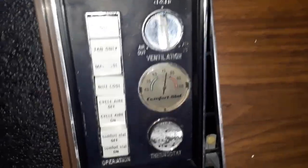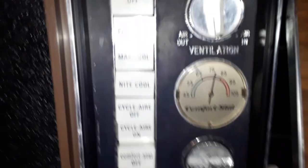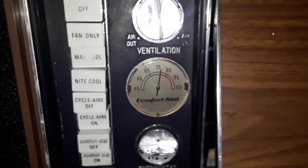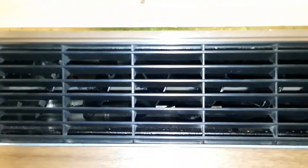She's holding head pressure pretty quick and the thermostat's maxed all the way out already. I wonder if I can tweak it so it gets colder than 65. I still gotta insulate the garage — the garage isn't insulated or drywalled up. Even putting a tarp up there would help, like a drop cloth.